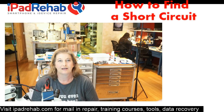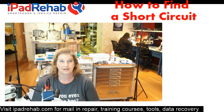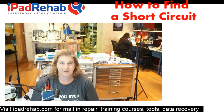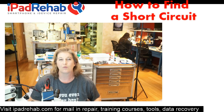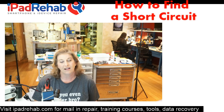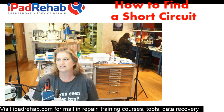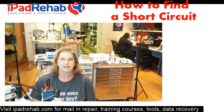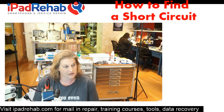So here's the lesson. Was the short internal to the PMIC? No. Was the PMIC the cause of the short circuit? No. So back at Juan's question at the beginning, what percent of the time is the chip that gets hot the cause of the short? I'll say 50%. It's a great tool, but you have to think. You can't just say, well, see hot, take off. That's not going to get you anywhere. That's just going to introduce variables to your board.